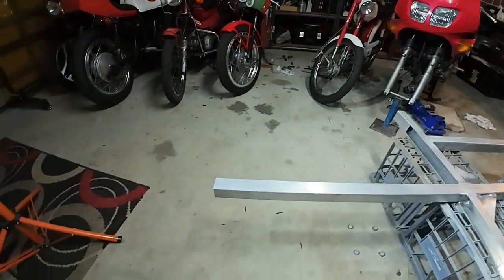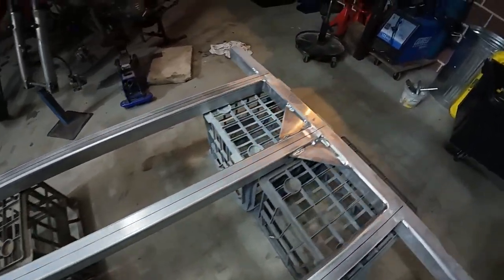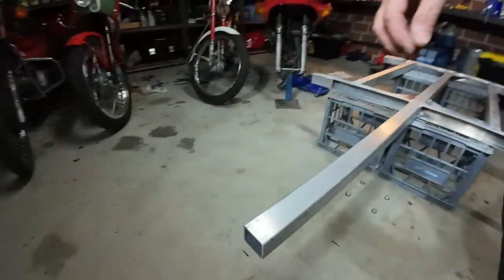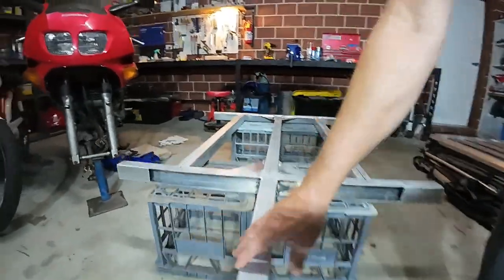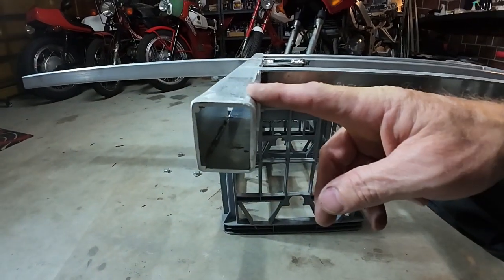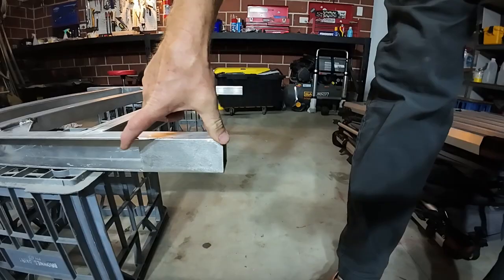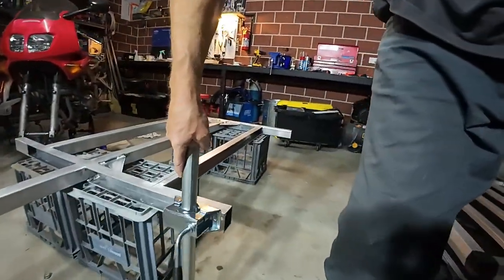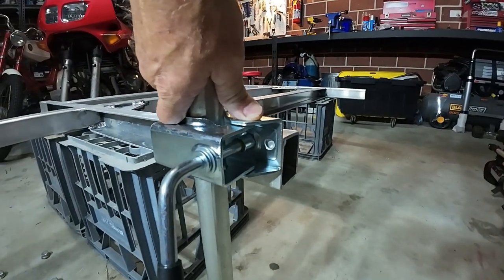Let's put the back screen on, okay. So we have this big, long, uninterrupted 50 by 50 box. This has a 4mm wall. There we go. It's lovely and thick. We then have 40 by 50 channel, which just has a closing plate on. The closing plate is to give these legs something to bolt onto. So I shall bolt those legs onto there for stabilising it.